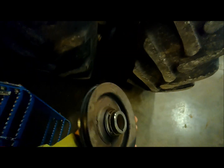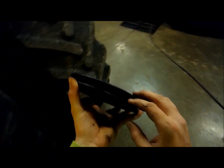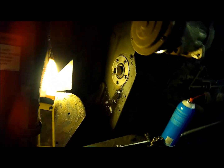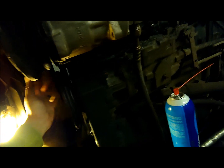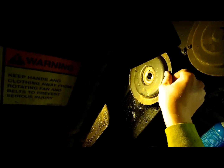Now obviously make sure it's cleaned off there, and then it's got a keyway in it, because this is actually how you time the engine when you're setting the valves and whatnot. It probably won't show up, but there's marks on this pulley here, and you line them up. You clean this off, there's a mark on here you line it up with. There.